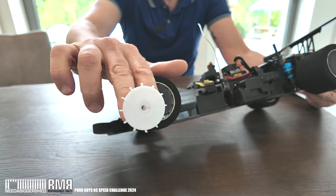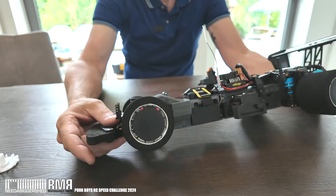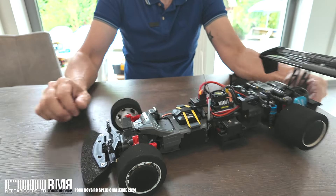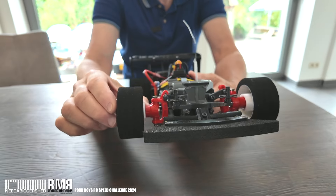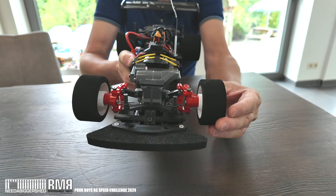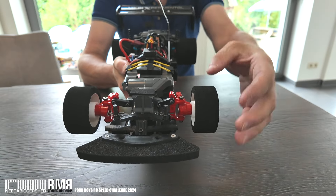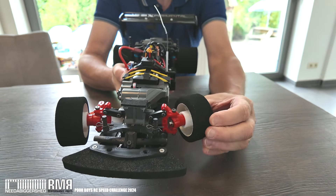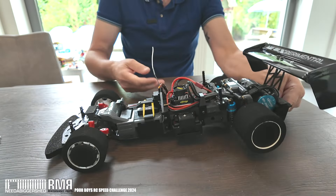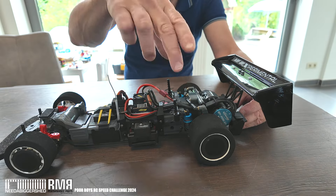On the front I used turbo fin fan wheel covers and stuck a plastic over that. It's quite a wide track, and the wheels don't really conform to a typical steering setup because the wheel is outside the rotational axis of the hub, so the wheels are going to scrub a little bit. But it's built for straight-line speed so I'm not too bothered about that.